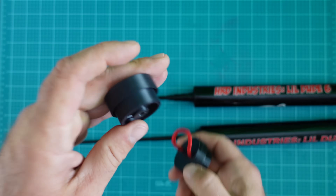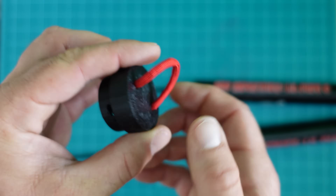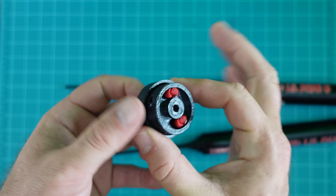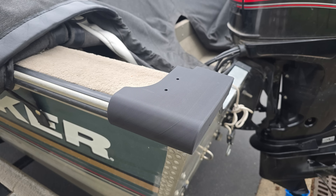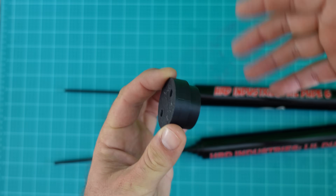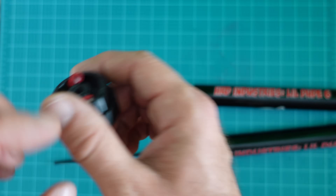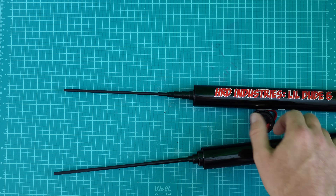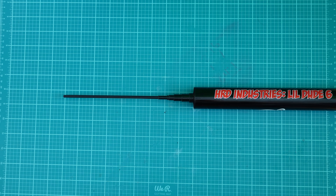My favorite thing is the version 1 cap — it was plastic, and plastic is fine, it worked well enough. But upon doing more research, I'm able to print something called TPU here at the office — you might actually hear the printers right now. TPU is a wonderful material that's flexible. The story goes: somebody needed a boat part recently, and I made it in ASA filament. The first time they were out boating, they tapped on a buoy and it broke the ASA — it's a hard plastic with no flex. While redesigning and reprinting the part in TPU, it works great because TPU is just a durable, strong material. It was suggested to me: why not use TPU for the top part? Not only does TPU work really well, it doesn't break.